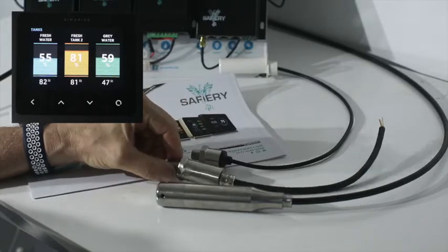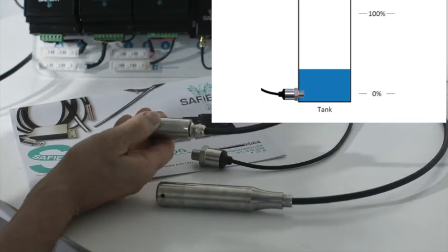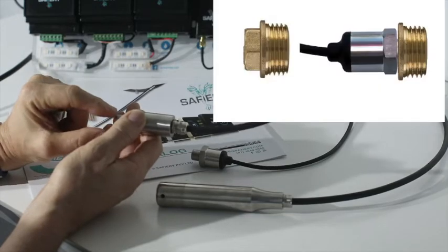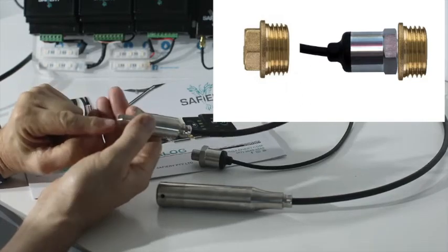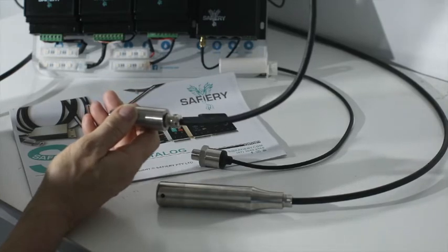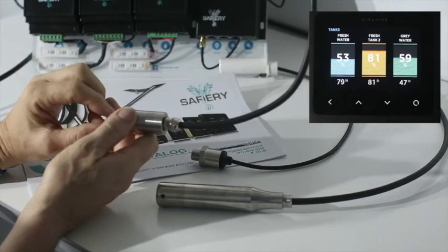These sensors measure the pressure of the liquid in the tank. If you've got a water tank that's fairly shallow — say 350mm high — this sensor is installed as close as possible to the bottom of the tank. Ideally the drain bung at the bottom can be drilled and tapped, and this quarter-inch MPT fitting is put in right at the bottom. The sensor measures the height of the liquid very accurately — within 2% of full scale — and then the CIMARIN system calibrates from that height into the actual volume in liters.